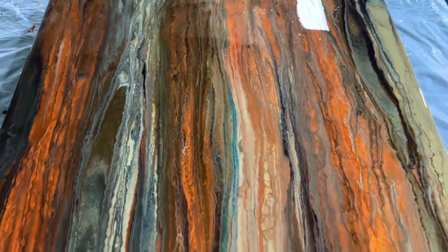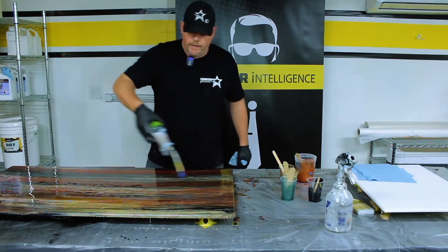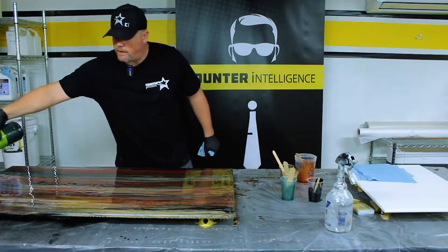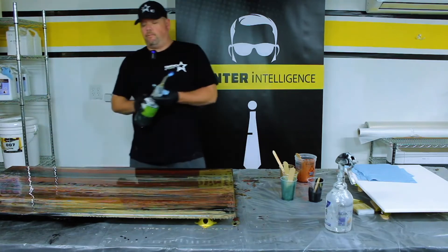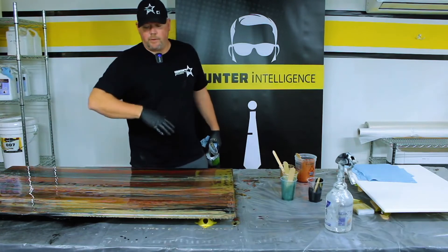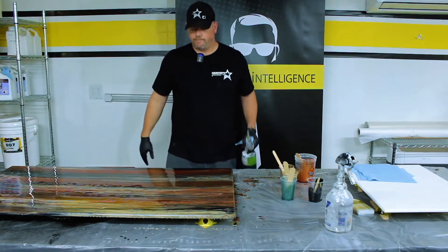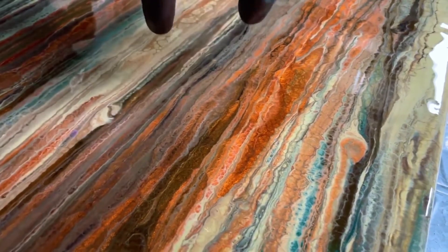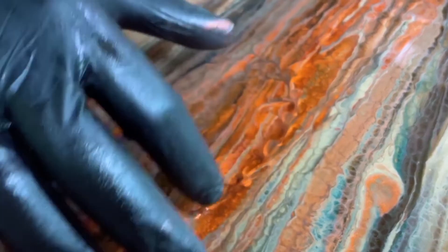This one has a few air bubbles. If you want to torch it, make sure you take your torch in the direction of your grain — whether it's a marble or a wood tone like this — because if you torch it late in the process it can wrinkle the epoxy. You'll see it in the depth of the epoxy when it cures — you'd see every single stripe you made with a torch. Right here we have a very large spot where a big drop of isopropyl hit and it's creating a big round spot. If that happens you can torch around the perimeter of where that's going.